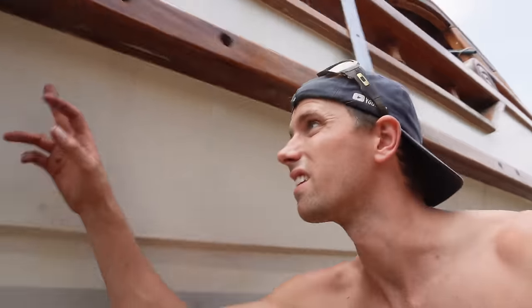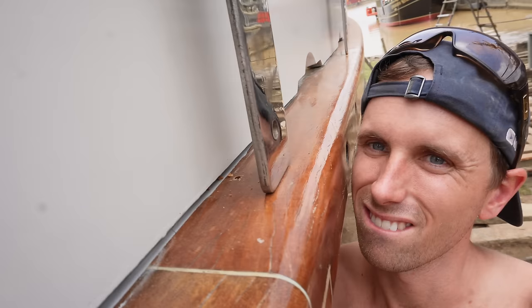And once the chain plate fits in from the bottom upwards, I'm going to just keep drilling from down to up through the next two boards later until it fits nicely. And then all I have to do is fasten it, mark it, and then we can bend that last little bit and then properly fasten it with all the Sikaflex and stuff. I think that's very happy. So through here and up over there. It's a little bit inwards up here because the top part of the cover board is wider than the bottom, so that makes sense.